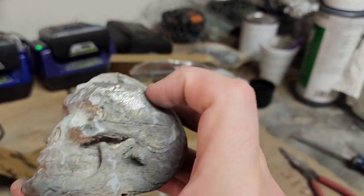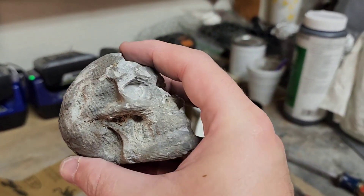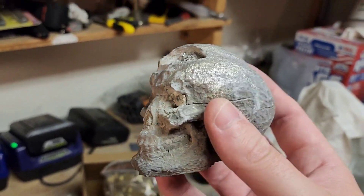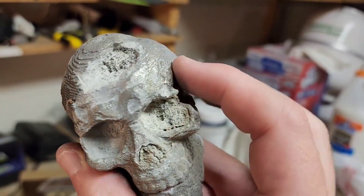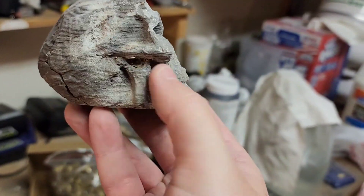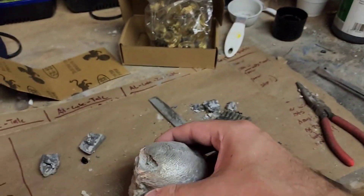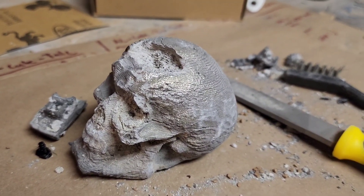This is a pretty large piece — it fits in the palm of my hand. This was all printed in Virtual Foundry aluminum, fully in an almost open atmosphere, and sintered in some consumer-grade microwaves. I'm going to clean this up further and share a few more pictures. Maybe a little bit longer sinter time might help densify it even more. Overall, very happy with how this turned out — good proof of concept for aluminum sintering at home in the garage.